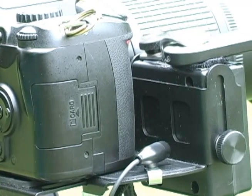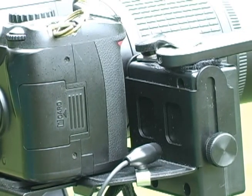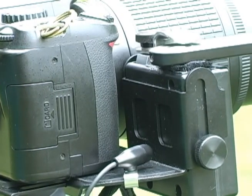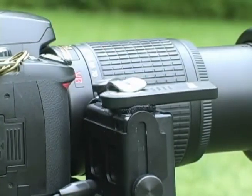I've put a little microphone on the mount so you can hear the button pusher arm mechanism working and so you can hear the camera beeping once a second. The 2-second delay allows vibration to settle down after the button pusher movement, so the only vibration when the shutter opens will be due to the mirror flipping up.